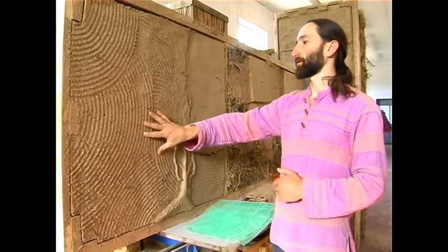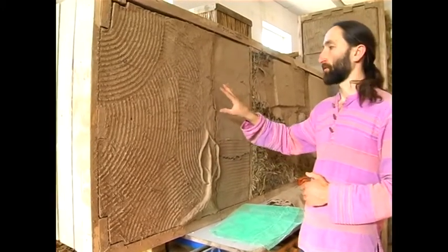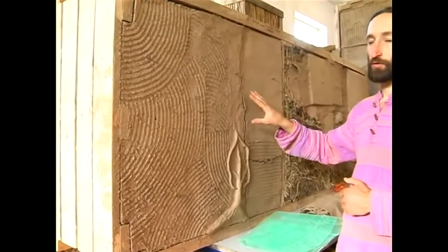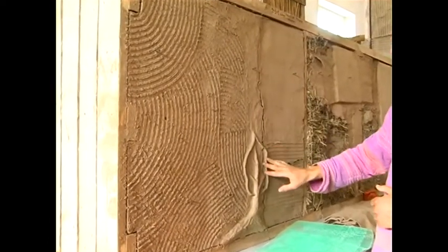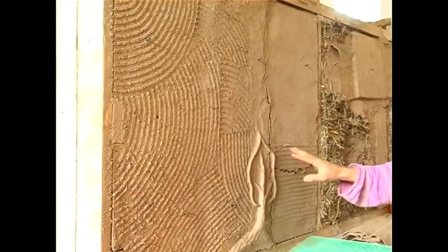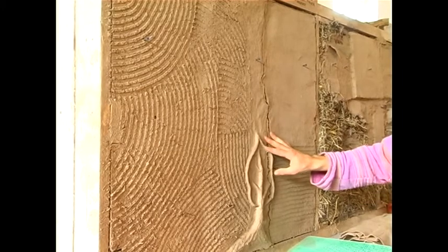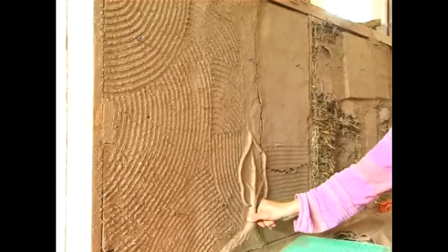On this part of the wall panel, we have tested different clay plasters as to their content and placed them at different times in order to test how it works. This crack indicates that the plaster content should be the same and the plaster should be applied at the same time. Besides, to test the endurance of the plaster, we have applied the layer.